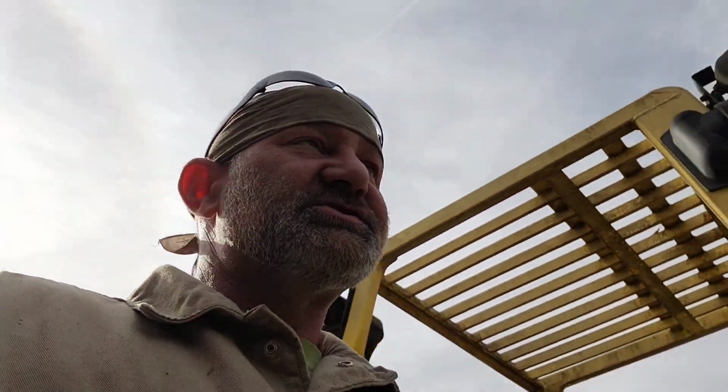You can help that situation by adding plate. You know, maybe you can weld a plate on there. In the situation with this truck right now, if I was going to start putting plates on there, I'd have to make a bunch of them, and they'd be a bunch of different kinds of plates because we got a bunch of little tiny cracks in different areas. So what I'm probably going to do is just weld over the cracks. It'll break again, but it won't be cracked, and it'll probably not be cracked for some time. Get a bunch of loads of logs in.